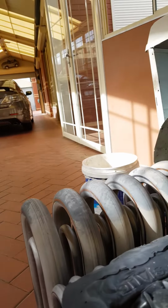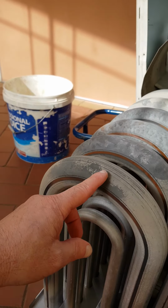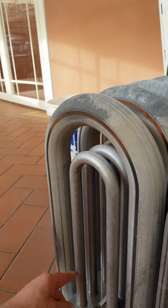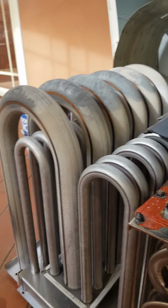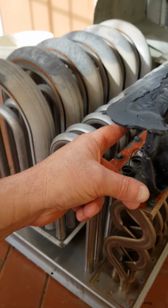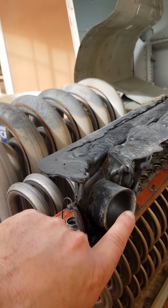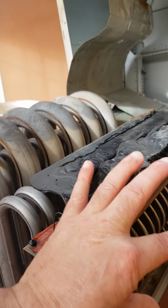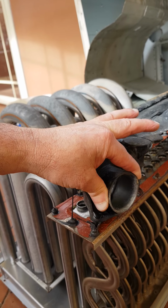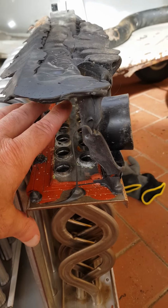So the way it works is the heat, which is the flame, runs up the tubes. Okay, we'll go down into this heat exchange here, into all these other tubes, through everything here, and this comes through this section here, out of here, and then through an exhaust or a flue. So this is your flue, and it's attached to the back of the unit through a vent. Okay, so this can have a lot of heat in it as well.